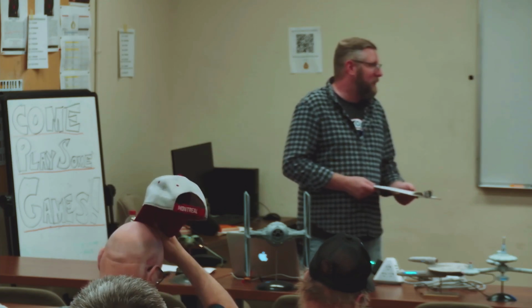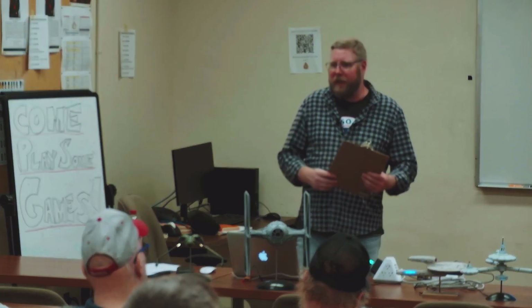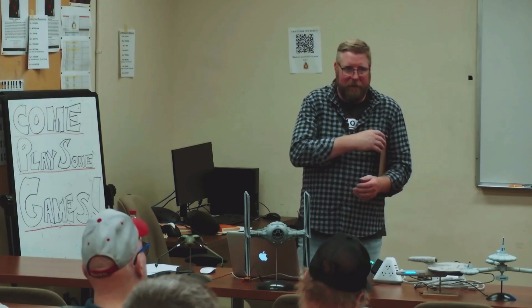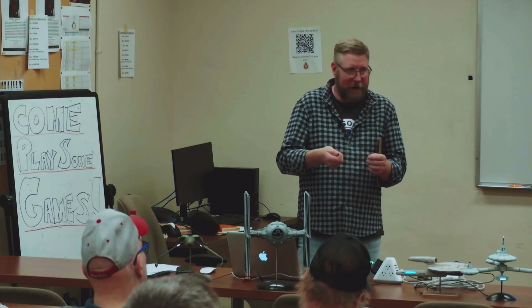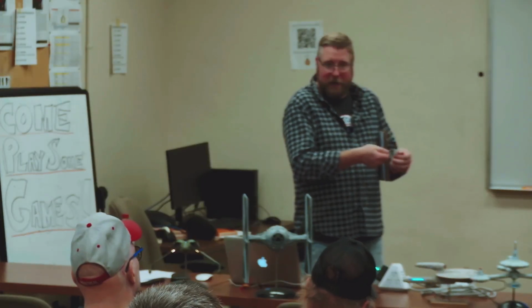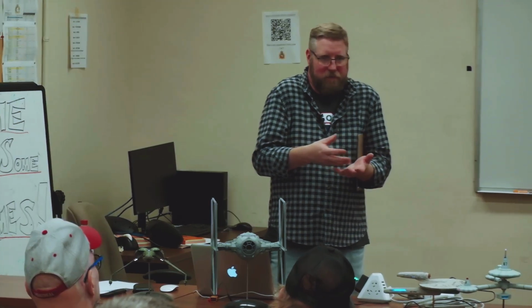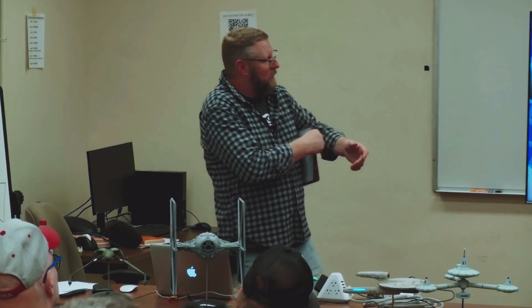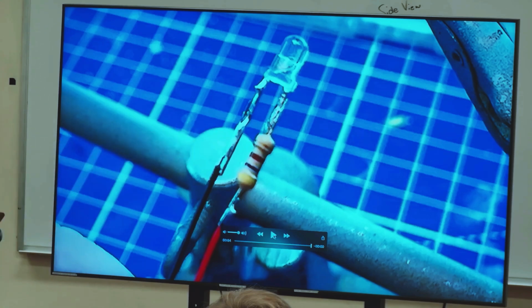But basically the big takeaway from that, very quickly going over soldering, is that pre-tinning is super important, and that is getting solder on the tip of your soldering iron, so that when you attach components, you get proper heat transfer. Without it, it just doesn't work. And that's why I also pre-tinned each individual lead. So there's already solder on it, everything combined gives you good flow, everything bonds together.